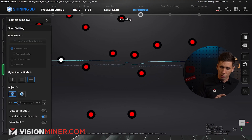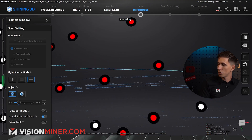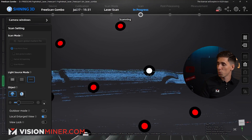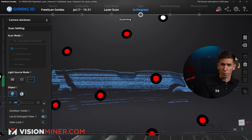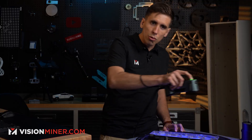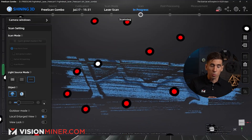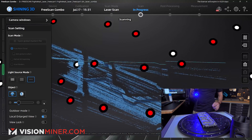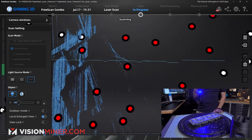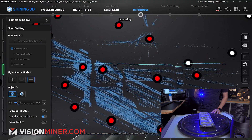I'm going to scan from one edge to the next. One of the biggest things about scanning in super high resolution is that you have to spend more time gathering points — per square inch you're picking up something like a hundred-fold as many points, so it takes a lot longer. At low resolution the whole thing would be done quickly, but at 0.05mm you really have to take a little extra time. That's one reason I like having an automated turntable — you can mount the scanner on a tripod, set it up, let it go, and come back in five minutes with a ridiculously high-detail part.